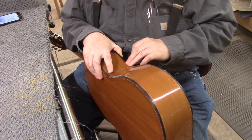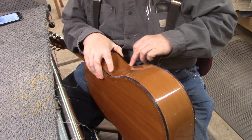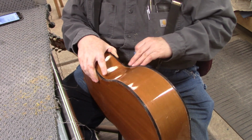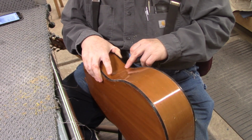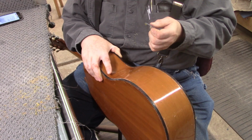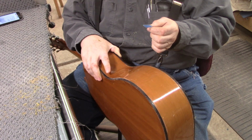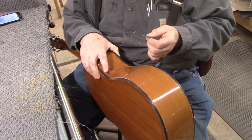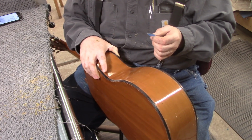Not too much. Just trying to, there's a little bit of an edge here right at the bottom where we put in the extra bit of that black line to raise up the binding. Yep. And so it's quite a little challenge to get that to scrape away without trashing out the finish. But these glass slides seem to work really well, and I've added a piece of tape to the slide which seems to stabilize it a little bit so it isn't so inclined to break. Good thinking. And if it does break, it keeps the shards from going all over creation. So into your fingers.